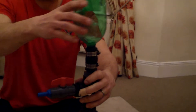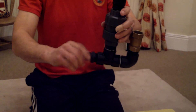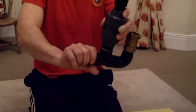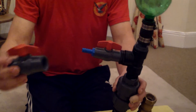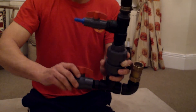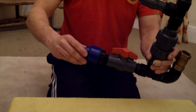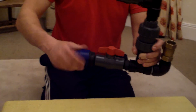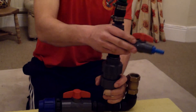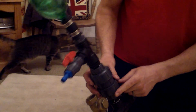It's coming together - almost there. The next bit is another union that screws on there. You can put PTFE tape on this stuff to get a good tight seal. Next, another on-off valve screws on there. And then finally we've got a compression fitting - a 32mm one - that goes on there. So your water comes in here, shuts this valve off, goes up through the one-way valve, pressurizes this, and is forced out there.